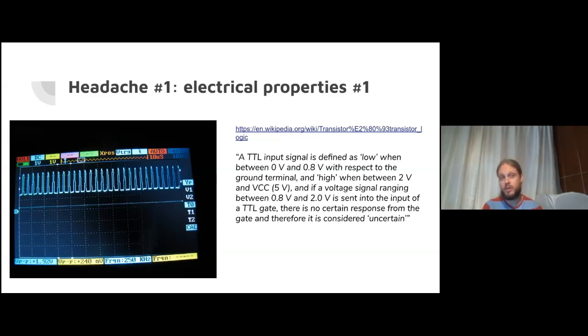That simply won't do. We're trying to pull the signal low to get the drive to sort of reverse its magnetic polarity on its head. And if we only pull low to 1.5 volts, that's not good enough. TTL requires you to pull it to 0.8 volts or lower, preferably much closer to zero. And whatever circuitry is on the video R pin is not able to do it.